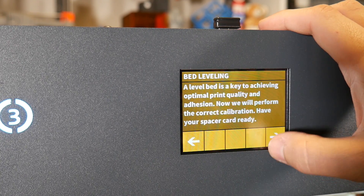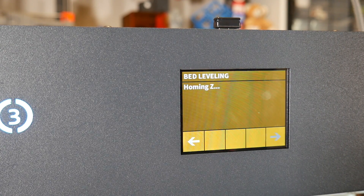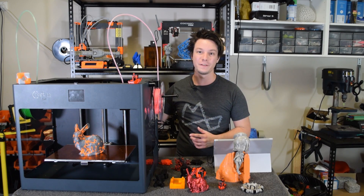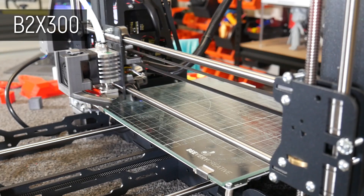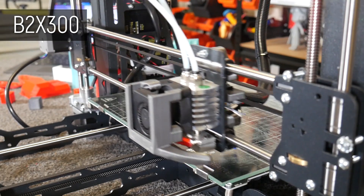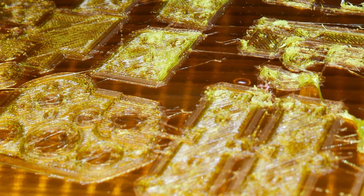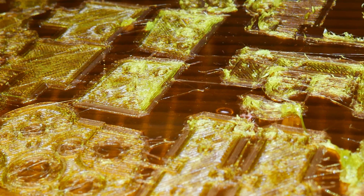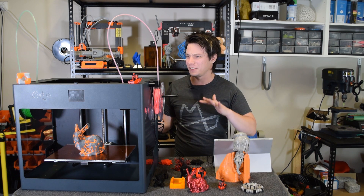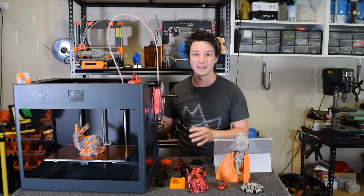On the note of bed level, it's still a manual affair. It's guided through a really good colour LCD touchscreen and it's easy to do, but with such a huge print surface, I really would have expected mesh bed levelling, like you see on the Prusa Mark III with induction, or the B2X300 with a motorized servo and a switch. You can easily fill a bed this large with parts, and if one fails because the bed level wasn't right, you're going to ruin the whole thing. And this isn't just a light usability complaint — it's actually really important because of thermal expansion.